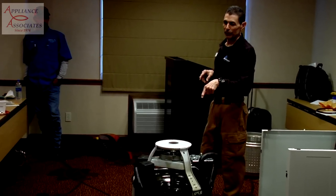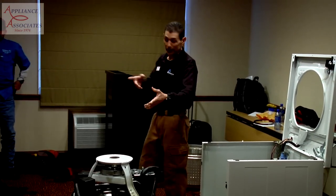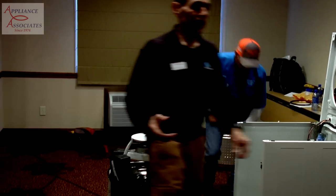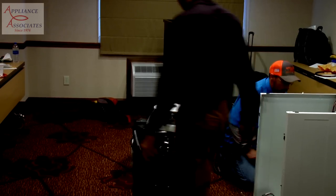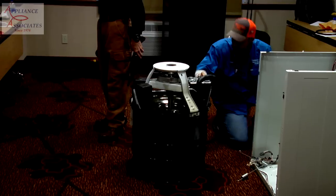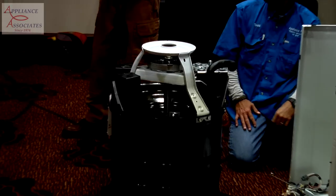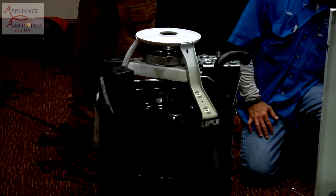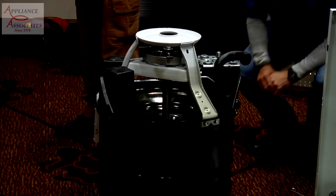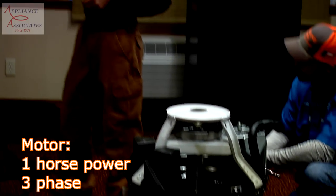You guys want to pull this off? Oh, no. Well, you can pull the motor off. Still can't get that nut off? No, I didn't try. We have the large. I don't think those will fit the tub in the shaft. Yeah, an impact is great. That's what I use. Did you say it was 38 millimeter? 38 millimeter or 1.5 inches. I think I might have one. For the nut here? Yeah, and on the inner tub too. Let's wait for him because this is going to be tricky to do with these. They're a good thought, but I think yesterday when they reassembled this, they cinched the nuts down.